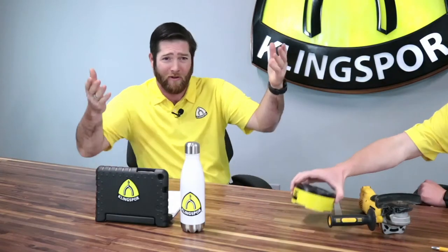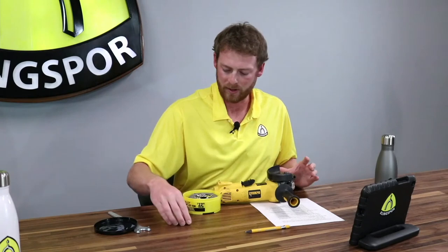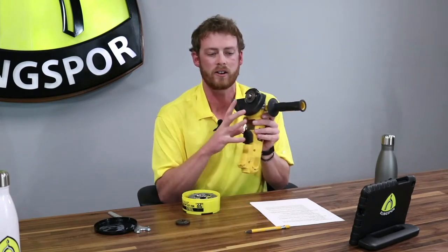I'm enthralled by this — how about a live demo on how to put these things on? We're going to go step by step on how to install these. We have a couple of components. First, you'll need an angle grinder. We only offer CMTs in four-and-a-half inch, so if you have a seven or nine inch grinder, this setup won't work. Be sure you have the four-and-a-half inch grinder.